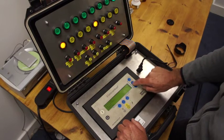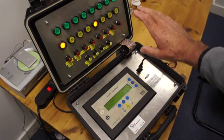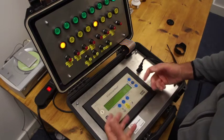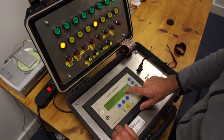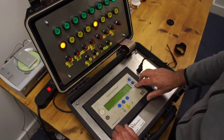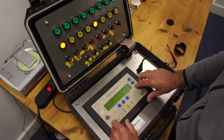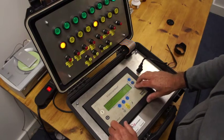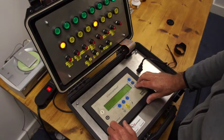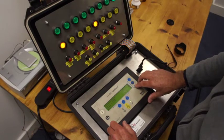For this first exercise we're going to press this button — the arrow has now changed to measured data. We press the to-and-fro arrows. I've put some settings in and on these settings we're going to have some pretty basic running conditions. This compressor has been set at 7 bar, which I'll go through later when we adjust that. It's showing the air filter DP which is normal, oil pressure normal at 2.6–2.7 bar. Press the arrow down again and you move to intercooler pressure, which I've set at a normal 2.1 bar.